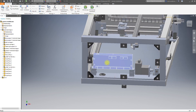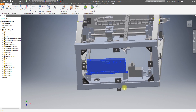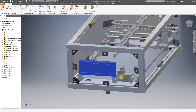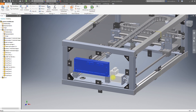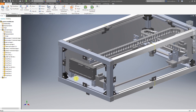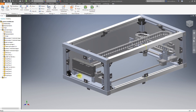Everything is attached to two base plates which then screw into aluminum extrusions. A stepper motor controller from Anaheim Automation is used to drive the two stepper motors. This connects to the computer by USB and generates all the pulses necessary to control these integrated stepper motors. These motors have drives built in — this is the controller for the drives. A grommet is used to protect the wires as they come into this enclosure, and all the wires have disconnects to allow this module to be separated from the rest of the machine.